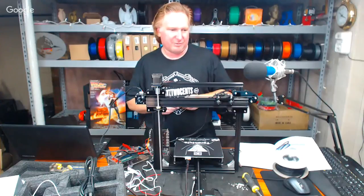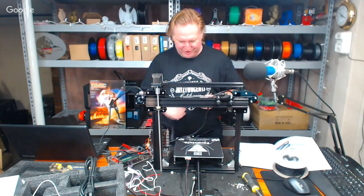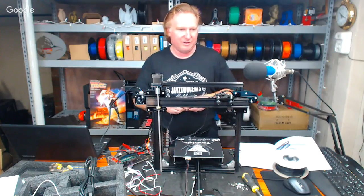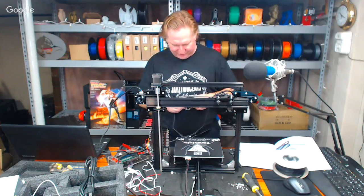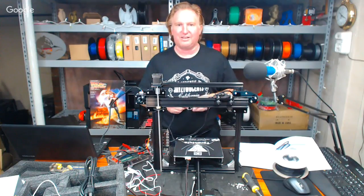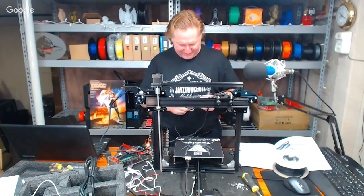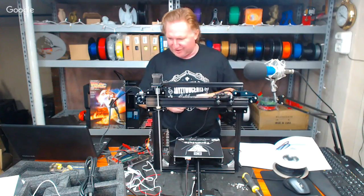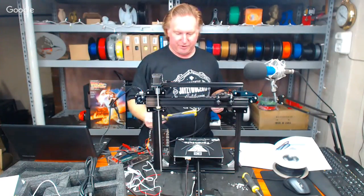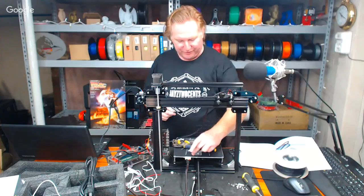The Prusa MMU is a multi-Bowden. That's what I've heard. I'll tell you my issue with multi-color printing when it comes to the way that it's being used with the MMU, with the palette and the ones like that. To me, it's a really great idea. But the problem is, if you've ever seen the purge block or whatever the company will call it, they have a tremendous amount of waste when you're wanting to print something multicolored like that. However you print it, let's say you're printing it this direction on the build plate, there's actually a block that has to print off to the side.